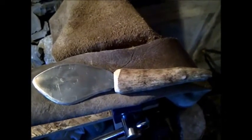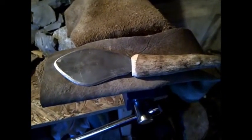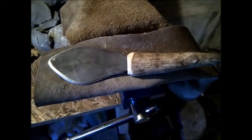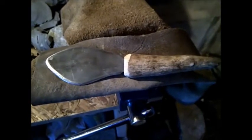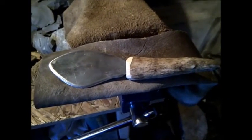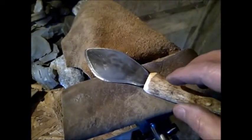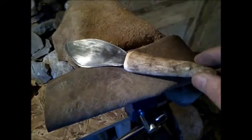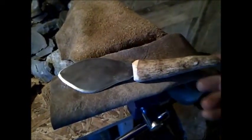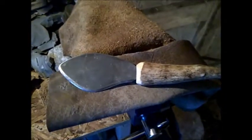It's not the prettiest thing you've ever seen — it's definitely rustic. But the reason I'm making this video is to show people who want to play around and make knives — it's for beginner knife makers just to give them an idea. I'm going to get the five-minute epoxy, fill that hole with epoxy, shove the blade in, wipe the excess off, and let it dry. Then I can sand the handle up and clean it.